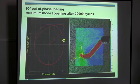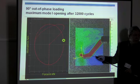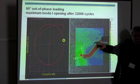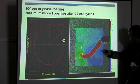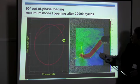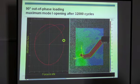So the point I have just shown you in the previous two figures and in the two movies, the crack tip was located here at that point, and I showed you that point because at that instant the crack became a kink. Maybe in the rear scenes you don't see that, but the crack now grew in that direction, and now we readjusted x and y coordinate systems and again plotted strains epsilon yy. These are now strains in this direction, and again here moment over force, and I have the associated movie with me. If we can show it, then I do that. Otherwise, we can watch that in the break.